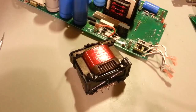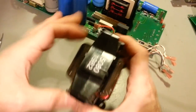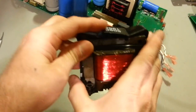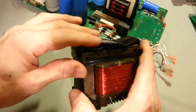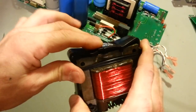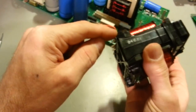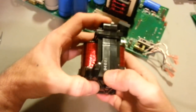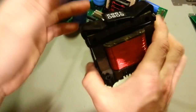So I'm going to say definitely repairable. I've already wrapped a wire tie around it here. I'll never get that re-glued. I probably could re-glue it, but I'd always be worried it's just going to break there again, because that's under a lot of stress. It's very springy, and it kind of snaps down in. See how they have the little dovetail there? So they put these things over top of it, and then they're pressed in, and it's probably a machine that does it anyhow. But yeah, there's a lot of stress on that, so it's just as easy.